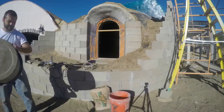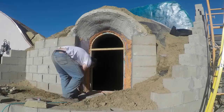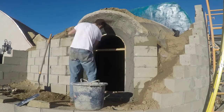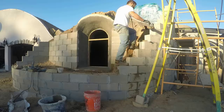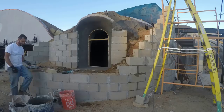For the benefit of my neighbors who have to look at this every day, I decided to also cover up the XPS and spray foam with some stucco. Here I am again spending a lot of time filling all the cores with concrete — a slightly wetter mix this time to make sure it can go all the way to the bottom — and then poking it with rebar to help vibrate it down.